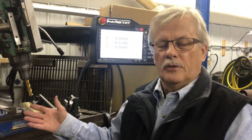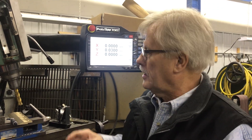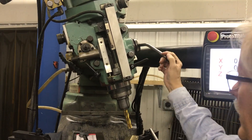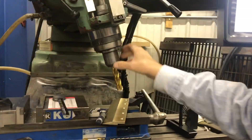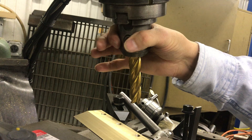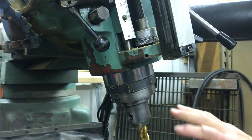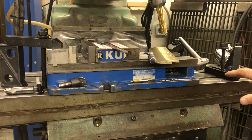Yesterday I did a bunch of stuff that I took for granted you'd know what I was doing, so I didn't really give a good explanation. Our spindle goes up and down — the end mill we used was held in an end mill holder with a set screw on the side to lock that end mill in there. That cutter is held in by a drawbar that comes down through the spindle. But we're mainly going to focus on the table situation here.